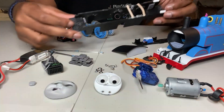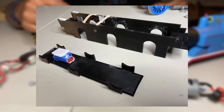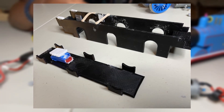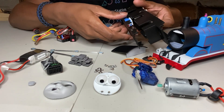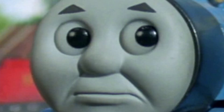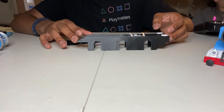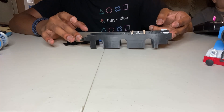The chassis I made is a simple chassis block that's made to pretty much look like the custom CNC aluminum chassis that Thomas' brass models were equipped with after Thomas and the Magic Railroad. In the spots where the axles are going to be, I made the openings a little bit bigger to accommodate the bearings on the axles, which I'll get to in a quick second.